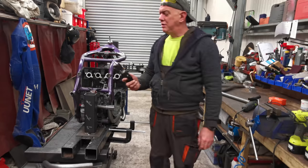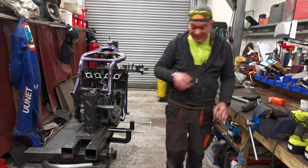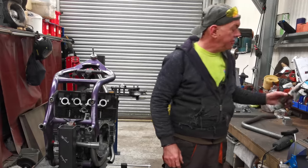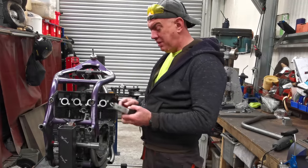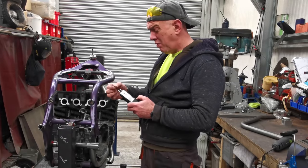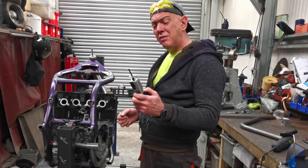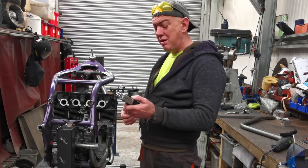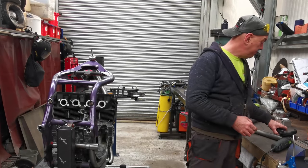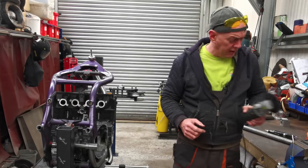That's what I've got. It's rubbish. Really, what, a reciprocating saw? Well, no, it's not rubbish. It does have its uses, but this ain't one of them. The blades have really, really, really fine teeth. Really, you want something like a 14 TPI. But the speed that this thing goes at is too quick. It'd be all right on thin, skinny stuff, but not chunky stuff like this.